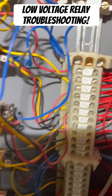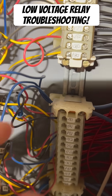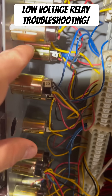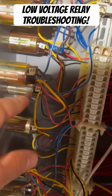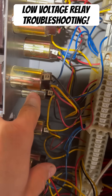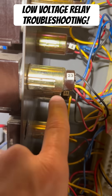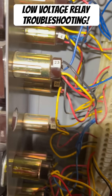Update: I held the blue wire, which is the 24-volt feed for the com wire, and had somebody upstairs hitting the switches — but it still didn't turn off. So I did what I do with automotive relays when they go bad: I tapped gently against the relay with a screwdriver. You could tell the coil inside was weak — it then engaged and turned the light on and off. That's the problem: bad relay number 24. We're going to swap it out with a new one and button this up.